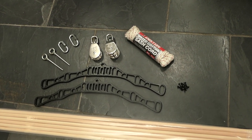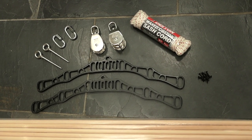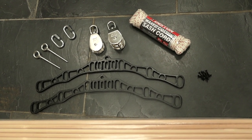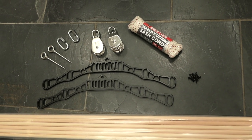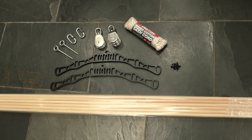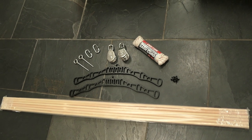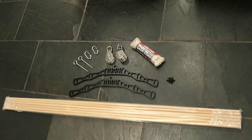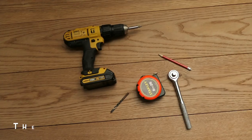I've got two 8mm screw locking carabiner clips and two pulleys — I'm using a 50mm double stainless steel swivel pulley on one end and a 50mm single swivel stainless steel pulley at the other end. I've also got two 8mm by 100mm stainless steel hook eye screws, and I'm going to use a metal cleat tie back for the rope to attach to.